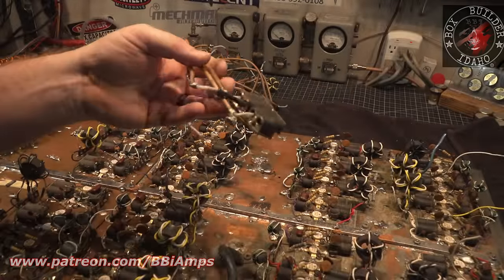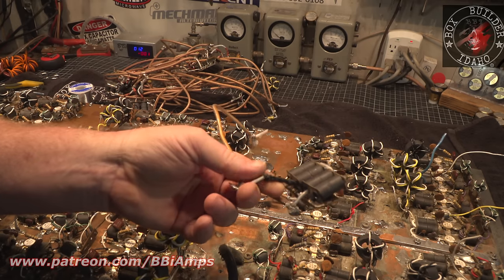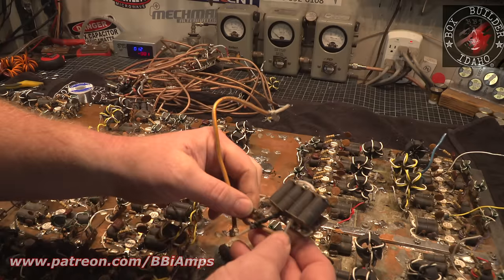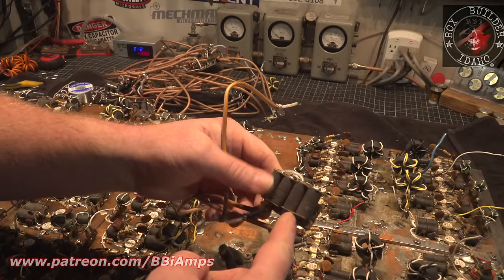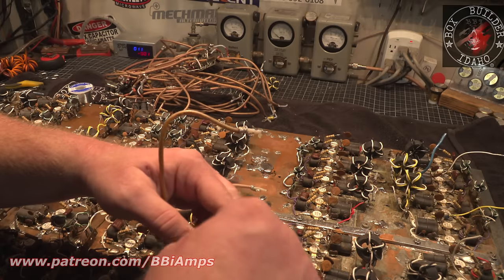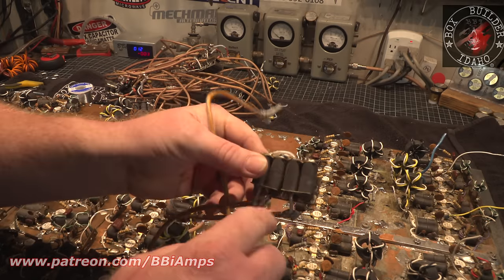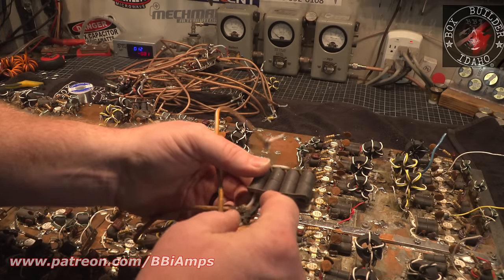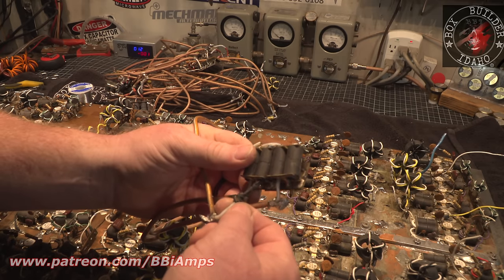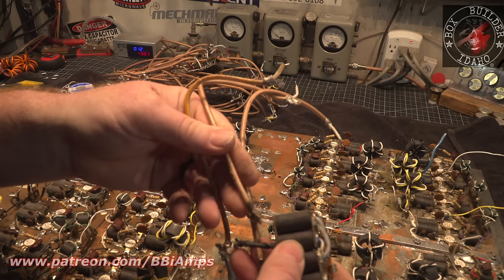Well, okay, so I wanted to show this. This here is a repair on top of a repair on top of a repair. Please note that we have the coax, direct fed, coax, direct fed. They go through and they solder, but in here someplace we've got Teflon wire. Then there's a joint, one here, another one just on the other side of this tube, and then a connector here. We can see on the coax where we've had continuous burning taking place.